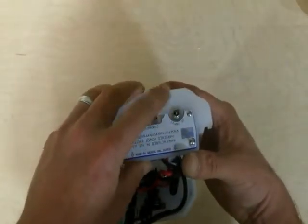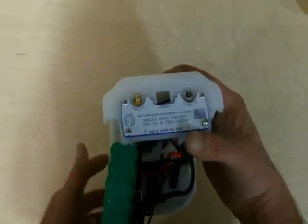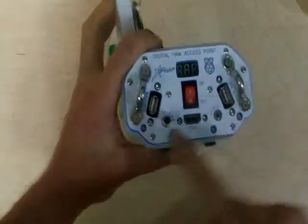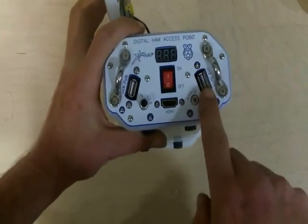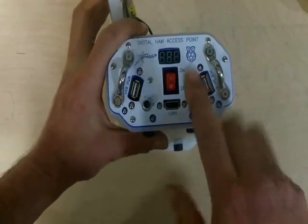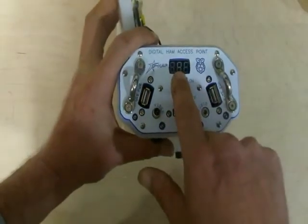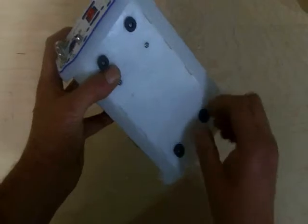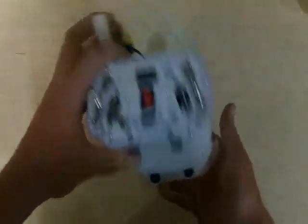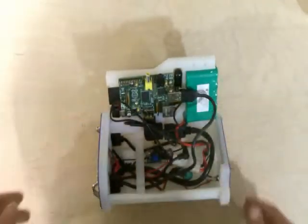Here's our DC socket for charging — this will charge off of our 5-watt solar panel, and it also ships with a wall wart for this DC port. On the front you've got two USB ports: one is power only, directly into the buck converter; the other goes into the Pi so it's data — you can put a keyboard dongle or whatever you want on there. This is the HDMI interface. There's the main on-off button and a volt meter to show you the condition of the battery bank. Some beefy rubber bumpers secured with stainless steel screws — we don't mess around cutting corners, whether you can see them or not.